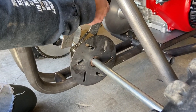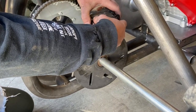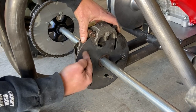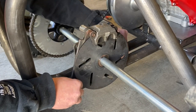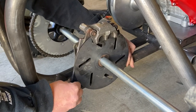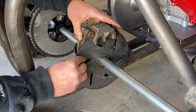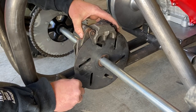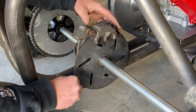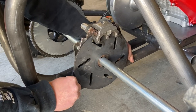Now, the reason I made articulating arms is because we can put this in position on the disc, which is Go Power Sports, as part of that whole assembly in the components list. And we can use the arms to set the exact position of this. Now, you don't want it riding on top of the disc. You want a little bit of clearance. You want the pads to contact completely, so you can just angle your arms to get whatever angle you want.